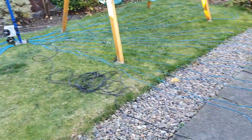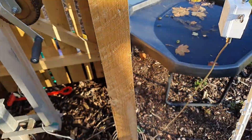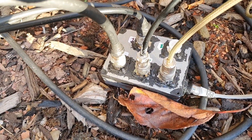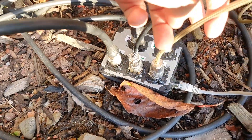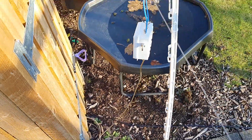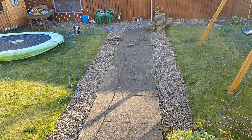So that's the antennas as set up, all connected to the remote switch — this is the GM6 remote antenna switch. The black coating is liquid electrical tape for sealing. We have coax going back to the radio from the off-center fed dipole, the phased verticals, and the loop, along with a CAT5 control cable and a switching cable that runs back to the shack and allows me to switch between endfire and broadside on the phased verticals.